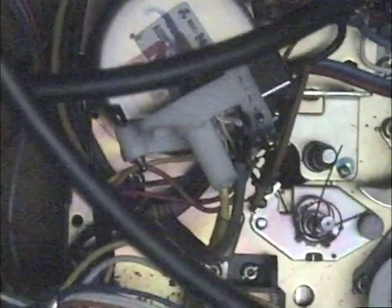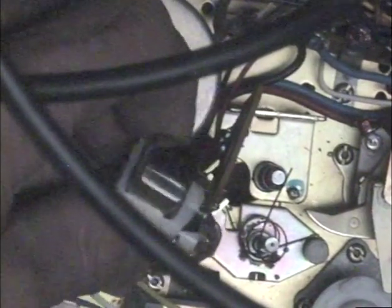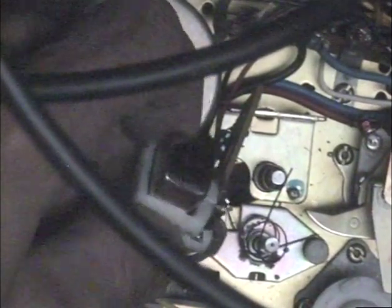So let's take a close-up from above of the unit that I'm working on now, the Sound Design, and here's basically the repair work I did on the bracket. One thing I'll say is that this screw coming down holding the head in place, of course, keeps this plastic bracket under constant tension, and that's why it starts to crack over the years. As you might know, plastic becomes brittle over the years when it's exposed to dryness and humidity and stuff like that. The plastic simply can't hold up, and as you can see, the crack on the top where the screw goes in is still visible.